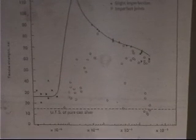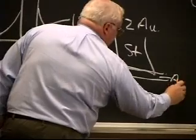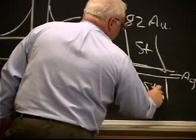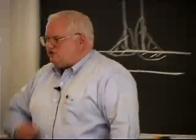So I've got a joint that is steel, silver as a braze, and steel. Well, the steel is plenty strong, but why doesn't the silver, which has a strength way down here at 15 KSI, limit it? How can I have a joint that has 110 KSI when I pull it in tension?